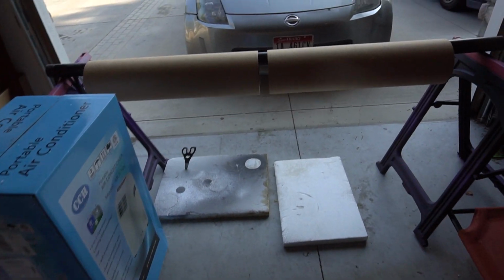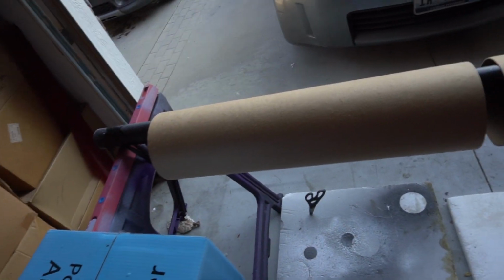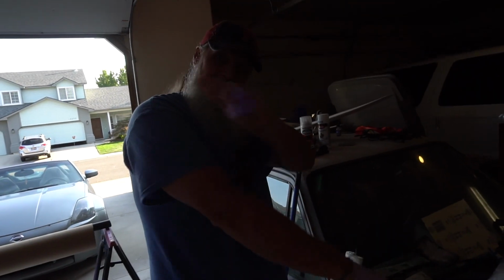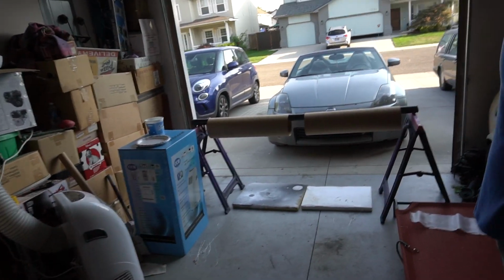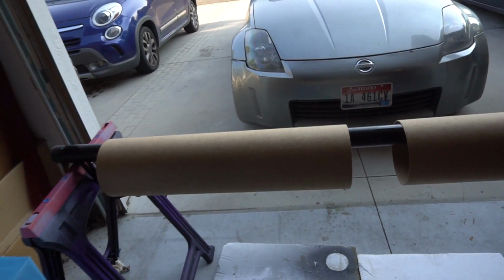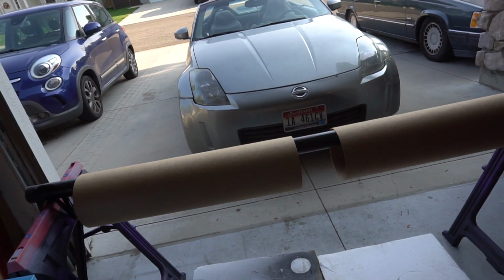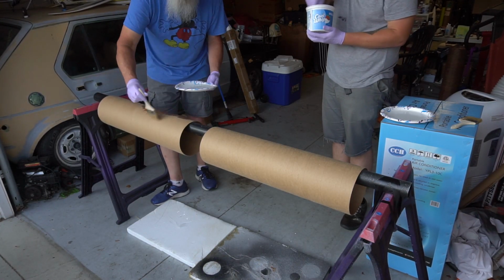Alright, I'm back. We're going to do 2 at once. My dad's going to help me out, so I'm going to cut the cloth and we're rolling. Look, Dad's helping. I can't even see very well, but so we're gonna do 2. Instead of doing 3 pumps on the tube before the cloth goes on, we're gonna do 5, and then hopefully we won't need to add a bunch of epoxy. We can just pull it all out with the brushes. I'll show you what I was doing that I figured out towards the end of the last one. That'll hopefully make the process a little bit easier and faster. Yeah, I spent a lot of time on the last one.